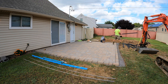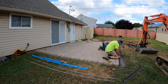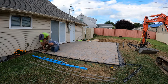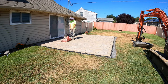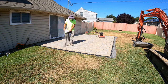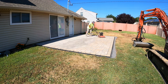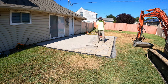Now we're putting in the edging strips. We put in 10-inch or 12-inch spikes every foot. Once all the edging's in, I do the first compaction, which compacts the pavers into the chip stone a little bit. Then I brush in the first layer of polysand, filling all the joints to the top, and then I run the compactor over the pavers again. This ensures that the polysand makes its way all the way to the bottom of the joint.